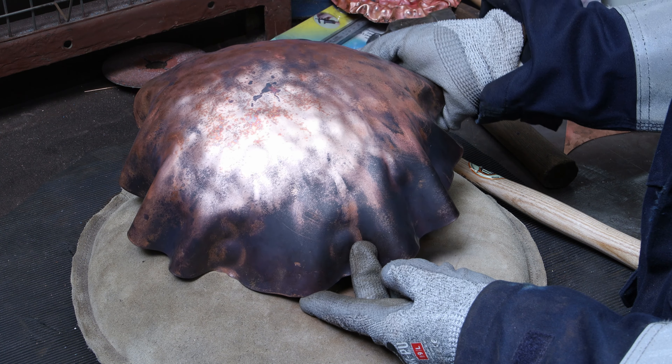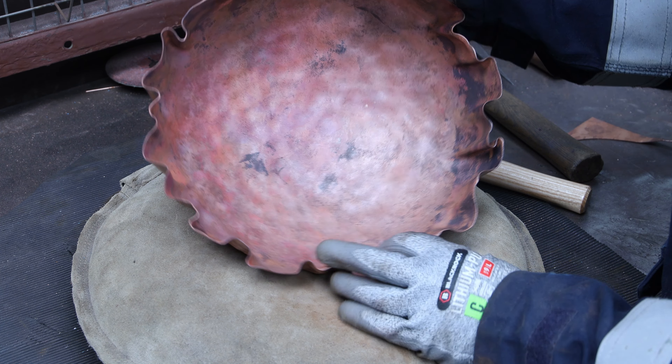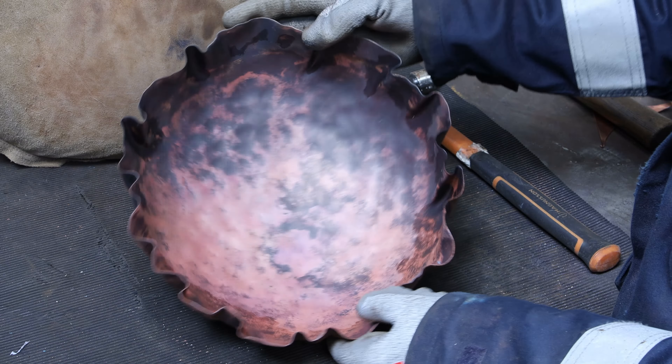On this run I'm getting closer and closer to the edge and go all over it until I get to the center. Once done I decide to hammer the folds. I didn't need to get too tight but I wanted to keep those folds in place and keep the metal tight on the edges to maintain the overall rounded shape. Then I'm back to anneal the piece again so it's nice and soft and I start working upside down.